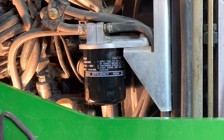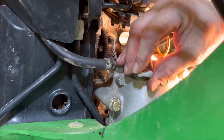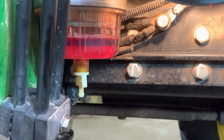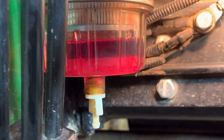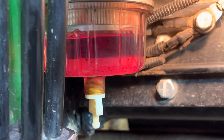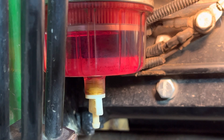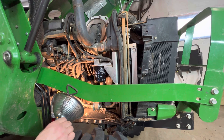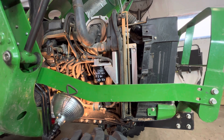What I like to do is write today's date and the current hours on the new filter. Then go ahead and turn the fuel line back on. As you can see, that's filling the bowl up pretty well. Next, turn the key on and let the pump slowly pull fuel through. Once it's filled, turn it off for a second, then turn it on a second time — that should be filling the primary filter up. You can hear the fuel pump clicking away, and you can hear the tone change in the pump as it fills.